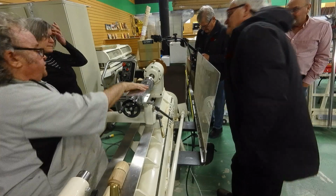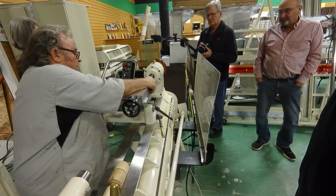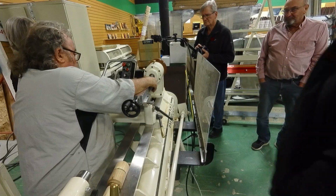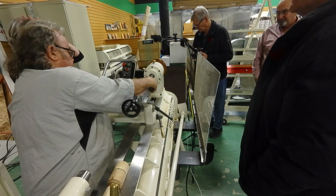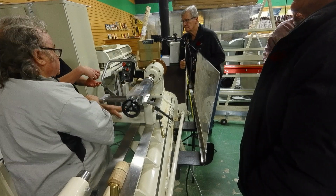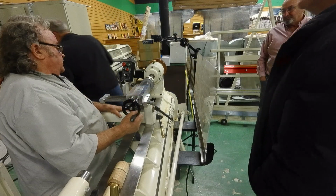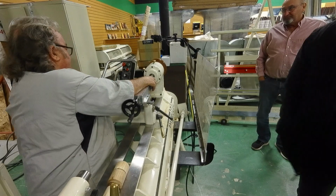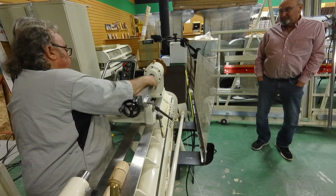Did you see when I was working with this, I advanced with the chuck? This chuck is not locked onto the spindle. I cannot lock it, there's no set screw on it. But just by the practice that I've had with this, and all the experience that Bert has with his, I rotate it by the chuck. It's like if you're doing a Forstner bit, you want to hold the chuck. You can advance this by the handle, but I feel I have more control here. The only thing you have to be careful with is that the cutter is turning, so keep your hands back, behind it.